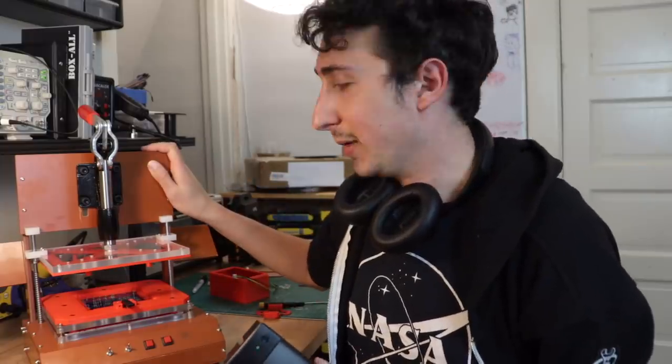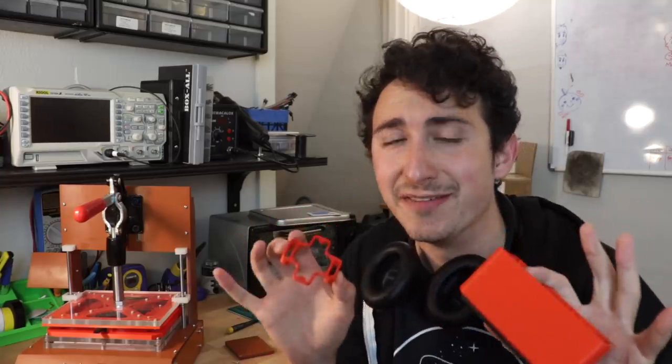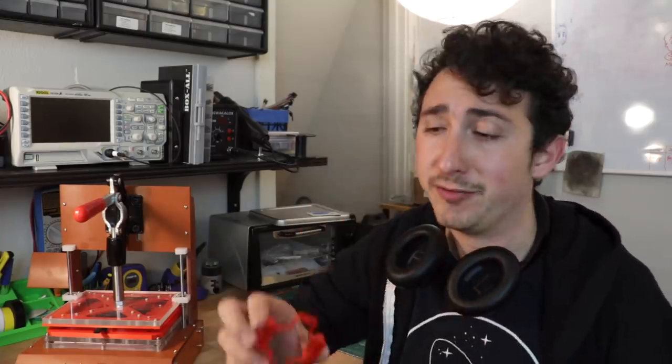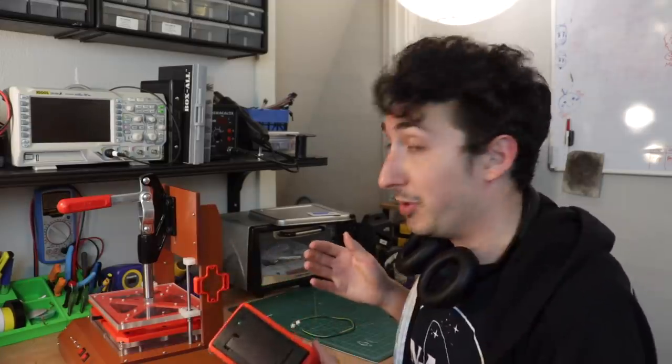Next, what we're going to do is design a mount for our thermal printer and install it on this guy, with the wiring running to the inside of the box. I came up with this print. What I like to do with 3D printing a lot of the time is make fixtures to make life easier. My hands are not very precise, so we need to put some precise holes in the side of this body so that this will bolt up correctly. I've 3D printed a little drill fixture — it has holes exactly where the holes on this print are and it's the same width as our side piece. I'll pop it on, mark the two holes, and drill it.